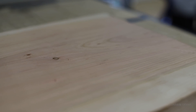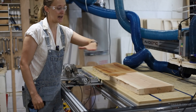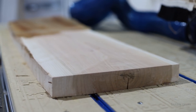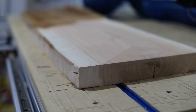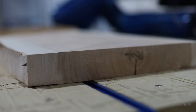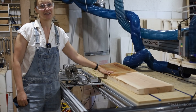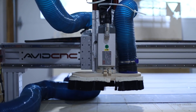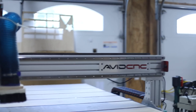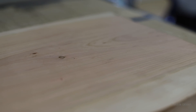I was going pretty fast — about 300 inches per minute — and going down about a quarter inch at a time. Overall this took about an hour to get to this point, which really isn't bad; the machine is doing most of the work. So if you have access to a CNC machine and you have a weird piece of wood, this is a really nice thing to do. Thanks so much for watching — let me know if you have any questions in the comments below.